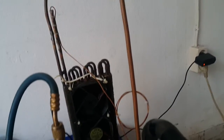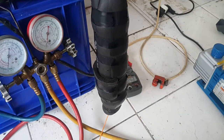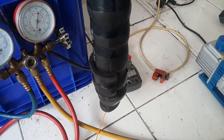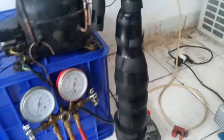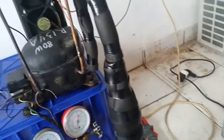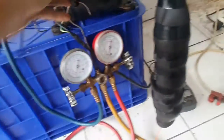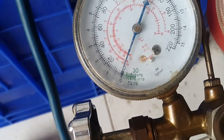Temperature and pressure — we have two. It just connects here to this evaporator down here. It's made of a small accumulator from a mini-split outdoor unit, just to prevent the liquid refrigerant from getting inside the compressor. Look at that — it's freezing, it's minus 27 now. From the small compressor! Look at the suction pressure — only two PSI. Isn't that amazing?